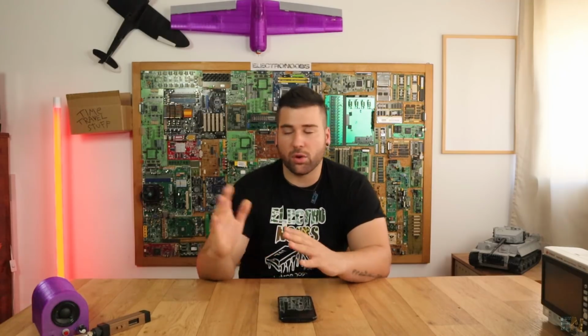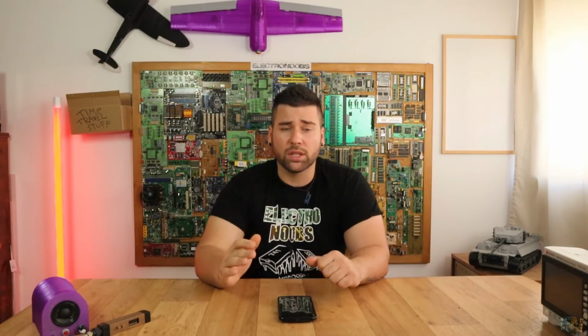So the most difficult part is the frame of the printer, not the electronics, because the electronics are just a board, the drivers for the step motors and the step motors with the supply. So you'll have to follow a schematic that is already online and maybe install the Marlin firmware, which is already made. It's very deep. If you want to make your own code, it would be very difficult. But if you use the Marlin code, you just have to upload it and that's it. So it's not very difficult.